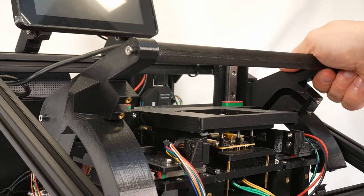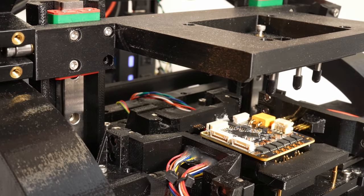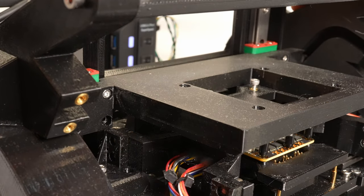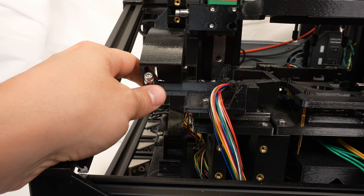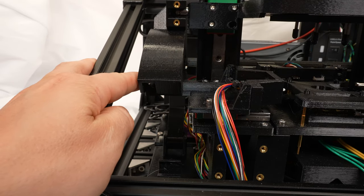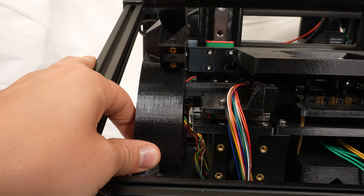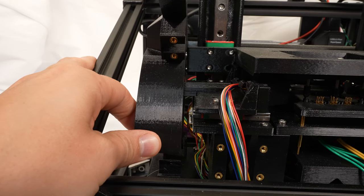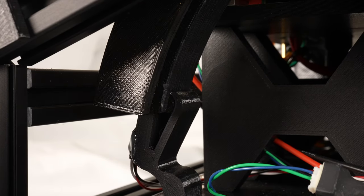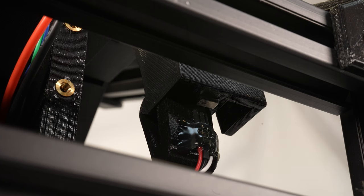A single main lever pull actuates the whole mechanism. First, the top plate moves down to clamp the board into position. Once it is in place, guided channels drive the HK0408 bearings to move the three side plates into position. A Hall sensor monitored by the I/O expander determines when the lever is engaged and activates the test cycle.